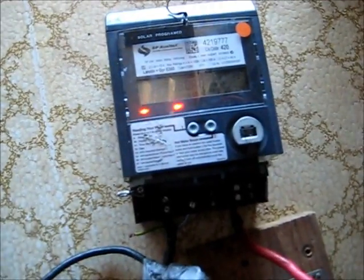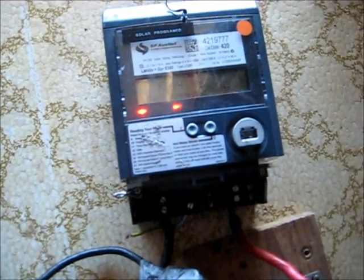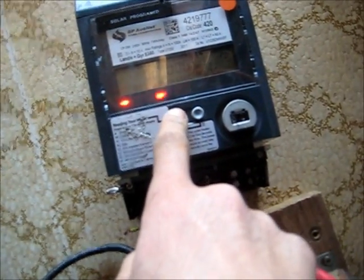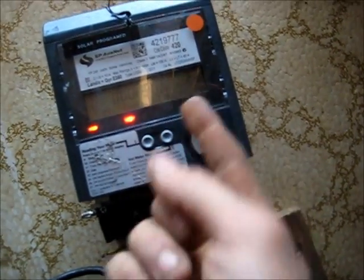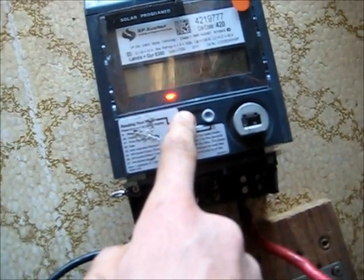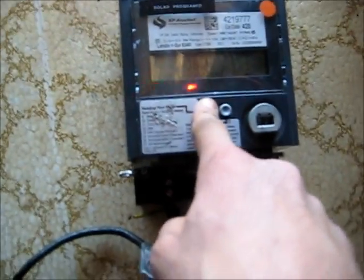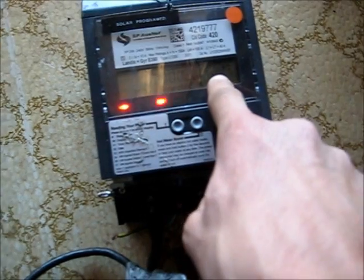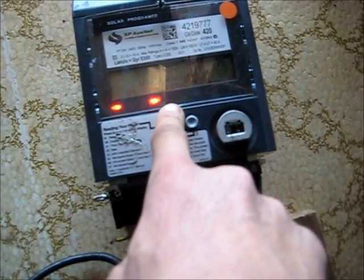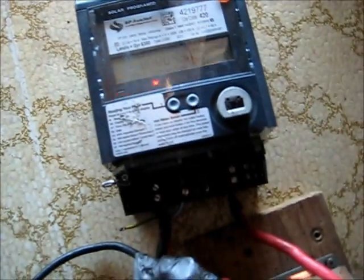VARH and the watt-hour lights are flashing. I thought that was supposed to pulse though — how does that work? KVAR is showing the arrow up and arrow that way. Before they were showing this way and that way, as if I was feeding back into the grid or something. 4.8 kilowatts — is that how much I'm putting in? Is that kilowatt hour? It says KW and the H is all the way over here, so I'm assuming that's kilowatt hour on one of the tariffs. Tariff A has got zero kilowatt hour, C has got 0.2, and 4.8 on the main tariff.